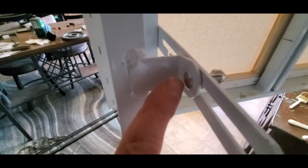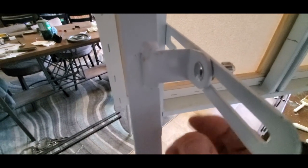For the adjustments on the top frame, tighten these as tight as possible. I picked up some wing nuts so that every time I need to adjust this a little bit, I don't have to go out and get my wrenches. I also bought a carriage bolt that fits in here — it has a square end — so I don't have to use two wrenches.